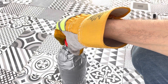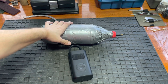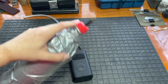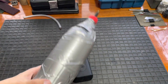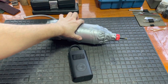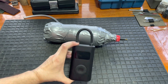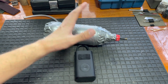So there you have it — homemade air compressor, pretty safe, a little bit scary but pretty safe. That is how you make your own homemade air compressor. I'll probably be taping up my other two bottles as well. I know the failure point was the valve in today's video, but after using these bottles repeatedly they do tend to crack around the base and rip apart. Duct tape like this should prevent any shrapnel and make them even safer. I'll try to leave a link in the description to where I bought the electronic pump on AliExpress — around 50 to 60 Brunei dollars, certainly a lot cheaper than a real air compressor and a lot more mobile.